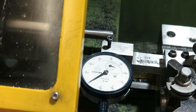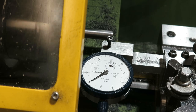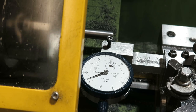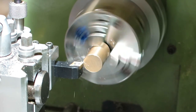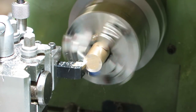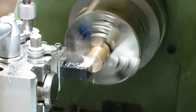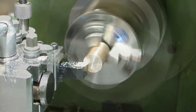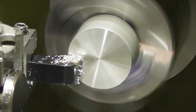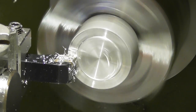I have to say I'm really happy with this result. I'm getting a runout of about 0.03mm at about 50mm away from the lathe jaw chucks, and I don't think that's bad — I think that's probably as good as I can really hope for. Unless you've been in the same position as me and you've also been trying to fit an 80mm chuck onto a lathe flange that doesn't fit the chuck, then you probably didn't find this entirely fascinating. But if you did find this useful and you did like the video, then please click the like button and please subscribe.